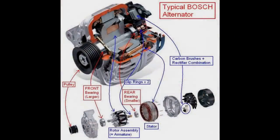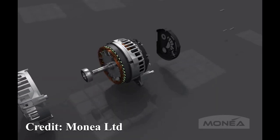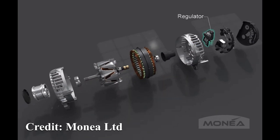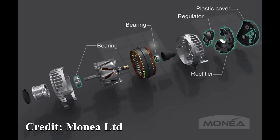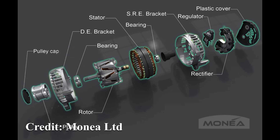If you look at the crab claws in a car alternator and compare them to the motor we've just looked at, you'll see that they're identical - a coil in that orientation, plate and fingers pointing down, and the flux at the edge of the fingers. So it is, in essence, an alternator. In an alternator, you create the magnetic field using another current, but in this little motor from the fan, that magnetic field is created by permanent magnets. We can do exactly the same thing with an ordinary car alternator. The bit we're actually interested in is the crab claw rotor.